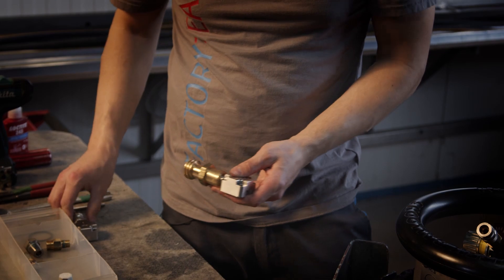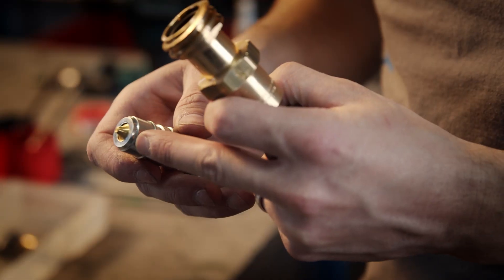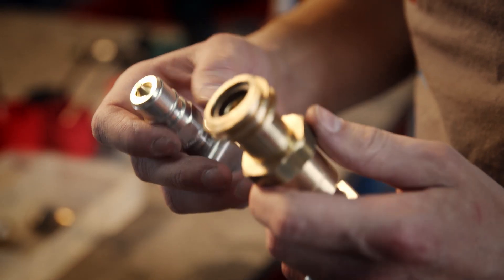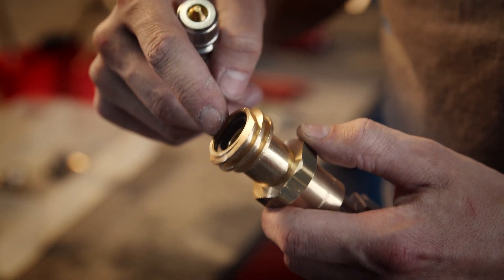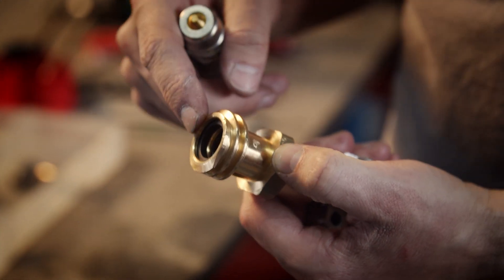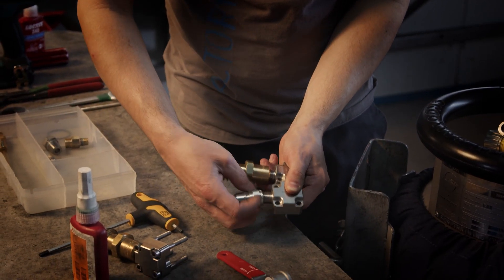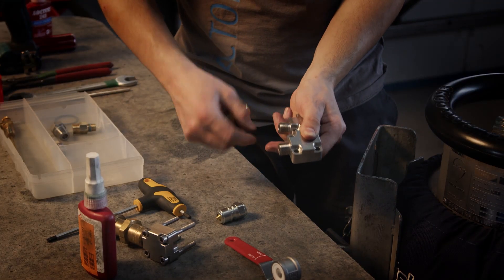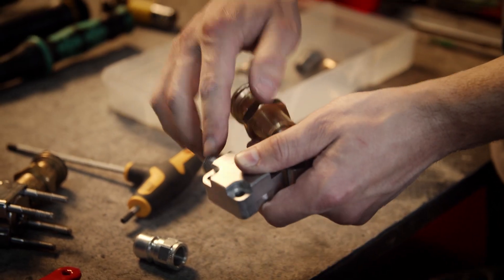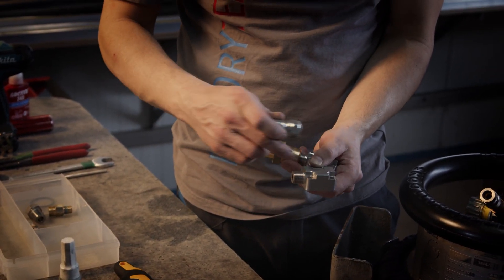You have two options: a Rego connector or a Tema connector. The Tema connector is without any changing parts, sealing, and so on. But in a Rego connector you can see two sealings, and if necessary you can change them. Remember that you have different threading on these parts — there is conical threading and a different type. So make sure that you put the correct connector on the correct body.